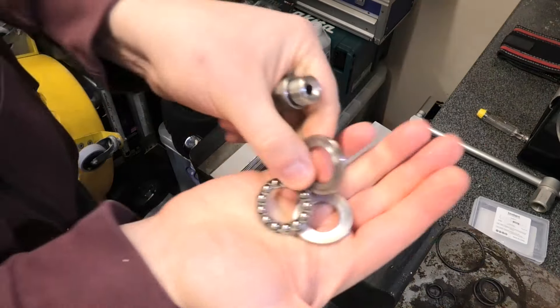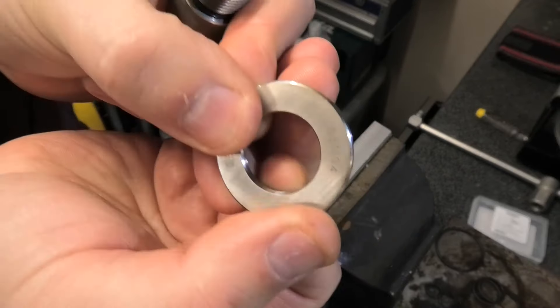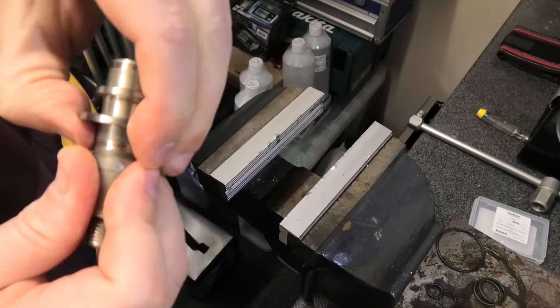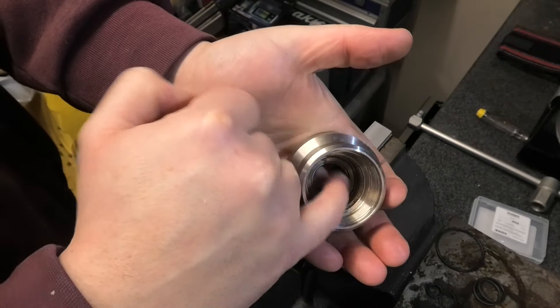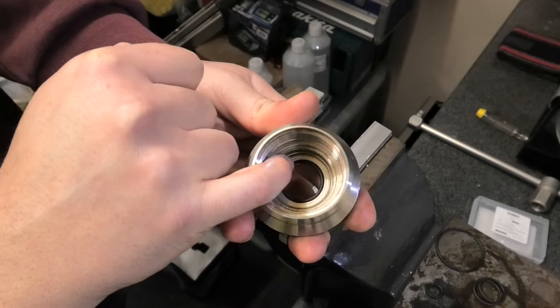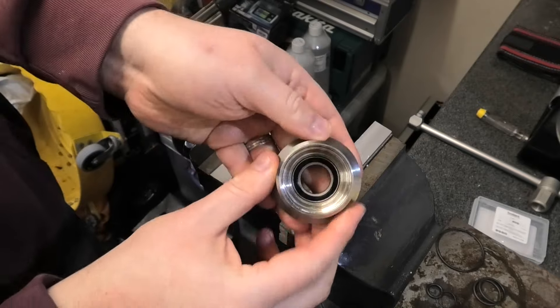There we have the first part of the main thrust axle bearing — there are the three parts together. Take one part of the outer race — you can see the number stamped: S51104 — and that simply slides on. You shouldn't need any physical force; it should just pop straight on fairly easily. Then there's going to be a 20mm by 2mm o-ring at the bottom, so pop that in. Take the other bearing that you've pre-greased and push it straight in — you shouldn't need any force on that whatsoever.